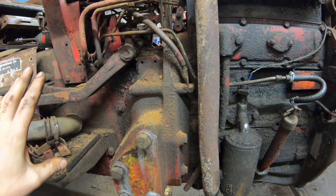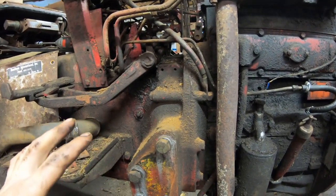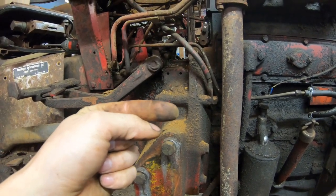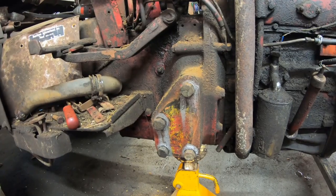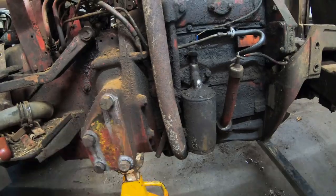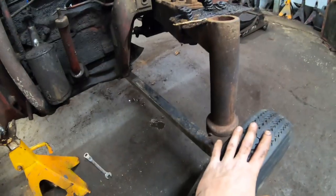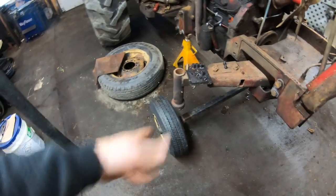You want it to come apart straight. It's not as critical coming apart straight, but I don't want to break anything, and also when it goes back together, it is extremely critical for it to be straight so that you're engaging with those splines squarely and it's going into your pilot bearing. You don't want to be misaligned. It's better to take the time to make a good setup to where when you're bringing these things together, you can do it squarely. You don't have to have the fancy pants tools. I'm not going to do it with the fancy pants tools. I'm just going to kind of make something up, and that's kind of my misfortune, is that I've already taken it apart. Because if I left it together, I wouldn't have to do what I'm doing now.